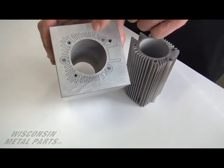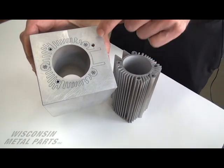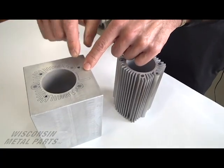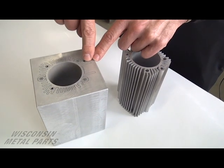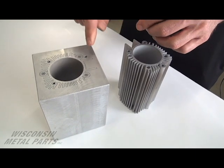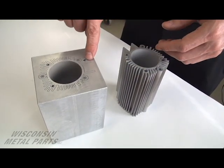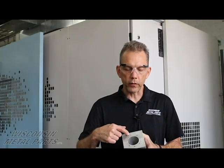What wire EDM allows us to do is take a block like this, prep it in our tool room, drill some wire start holes, and as we come into the machine the wire machines are capable of auto threading. They're going to come down, thread through the hole, pull it out the bottom as the wire goes through the machine, and it's going to go all the way around and do what we would call a rough pass. So we're going to have high power and high pressure on our flushing to get all that debris out as the material is eroded.